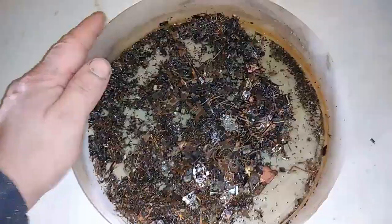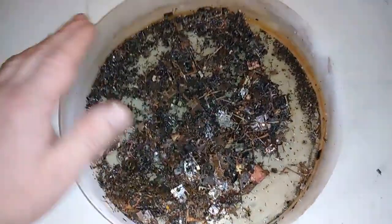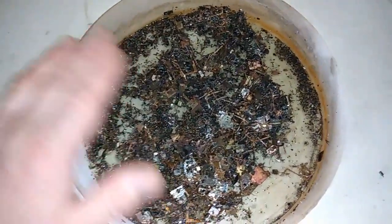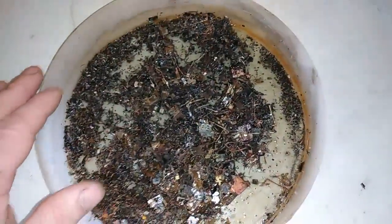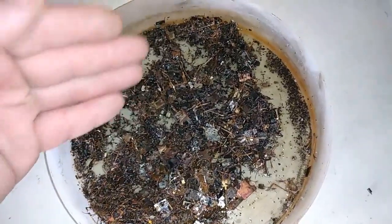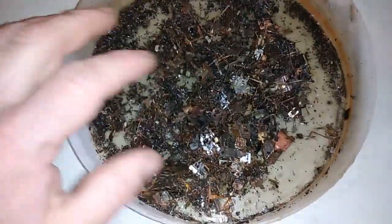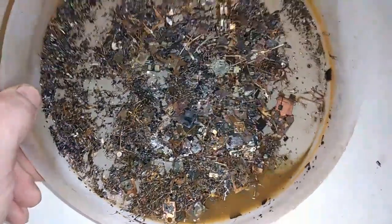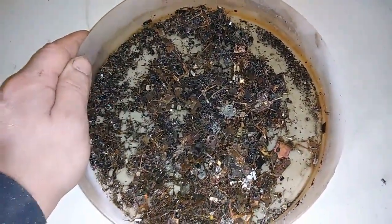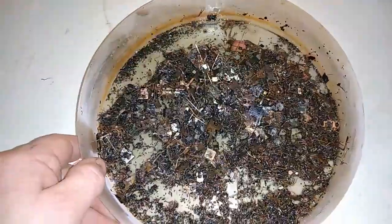is metallic parts. And to use the normal process to dissolve this in nitric acid would eat an enormous amount of nitric acid. Reverse electroplating, no, definitely not, because I got here a lot of small particles, so I cannot do that in the right way. Probably will lose the contact. So the process which I will use is my acid mix, my gold stripping solution with the sulfuric acid and sodium nitrate. I think that this stuff will definitely remove all the gold but leave everything else.